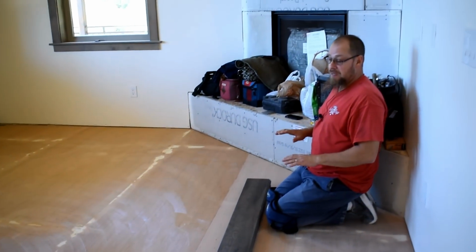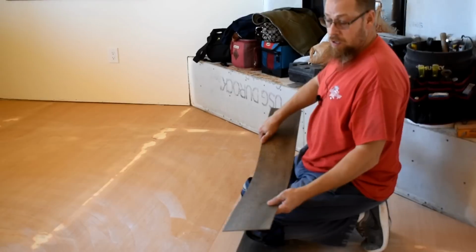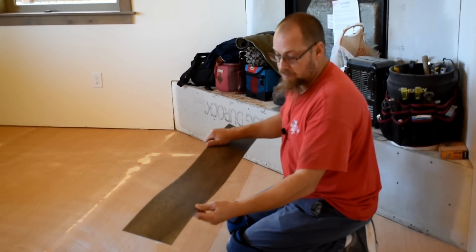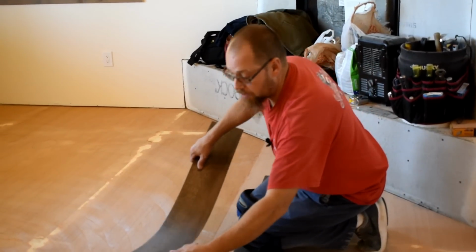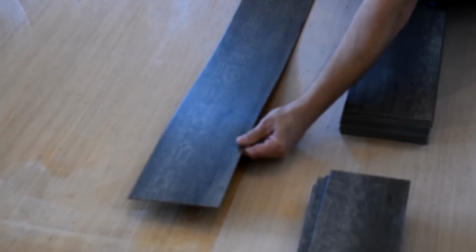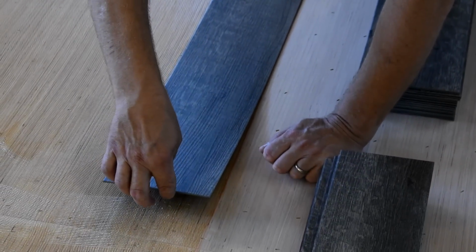And as usual, we're going to make sure that our very first piece is 100%. As always, if we get it off, every one of these rooms, this whole downstairs matters according to this one piece. If we get this one piece right here crooked, everything in the whole downstairs is going to be crooked because it all touches. So I'm going to be extremely careful here and try to get it dead on my chalk line before I do any touching or anything.